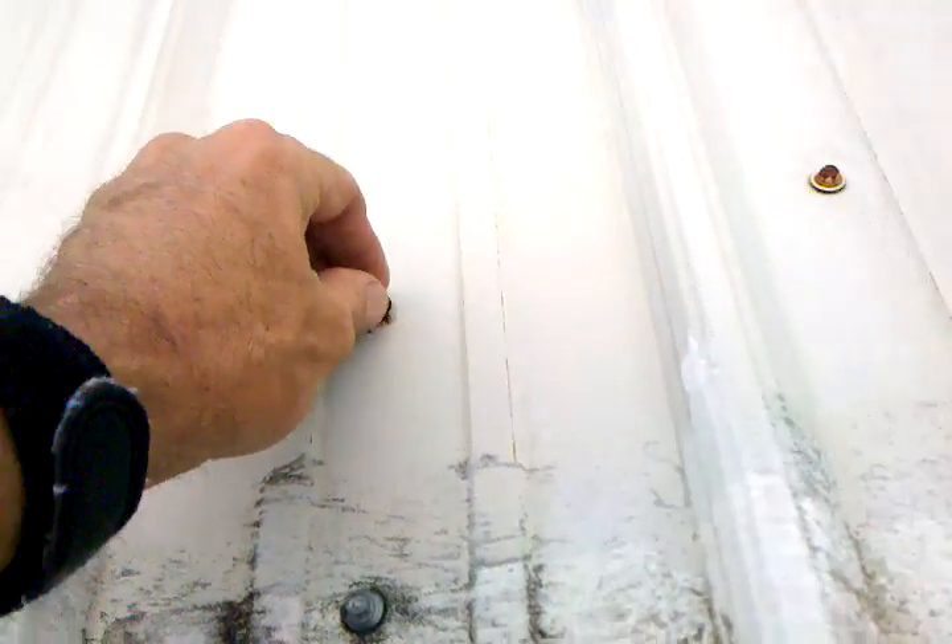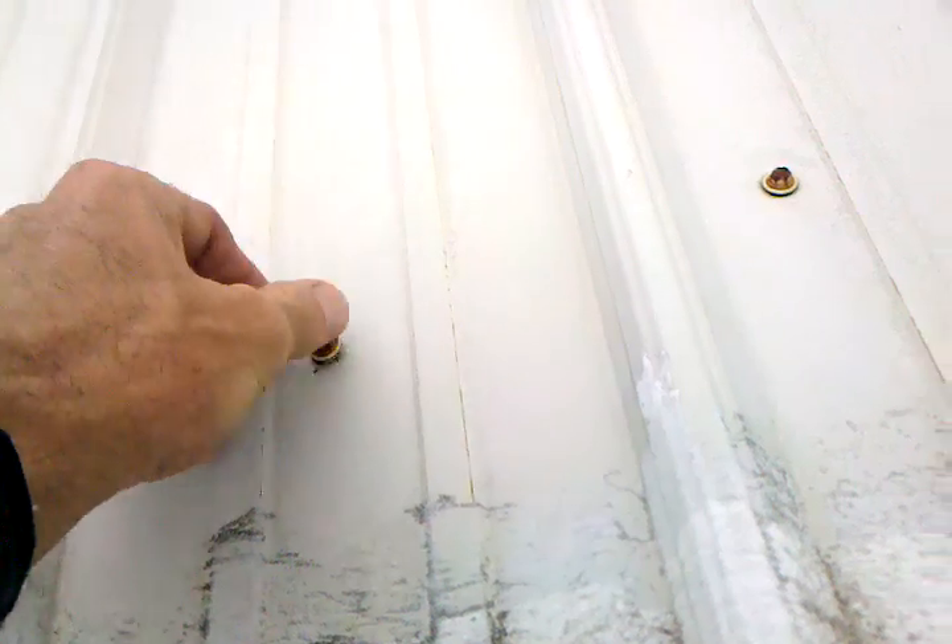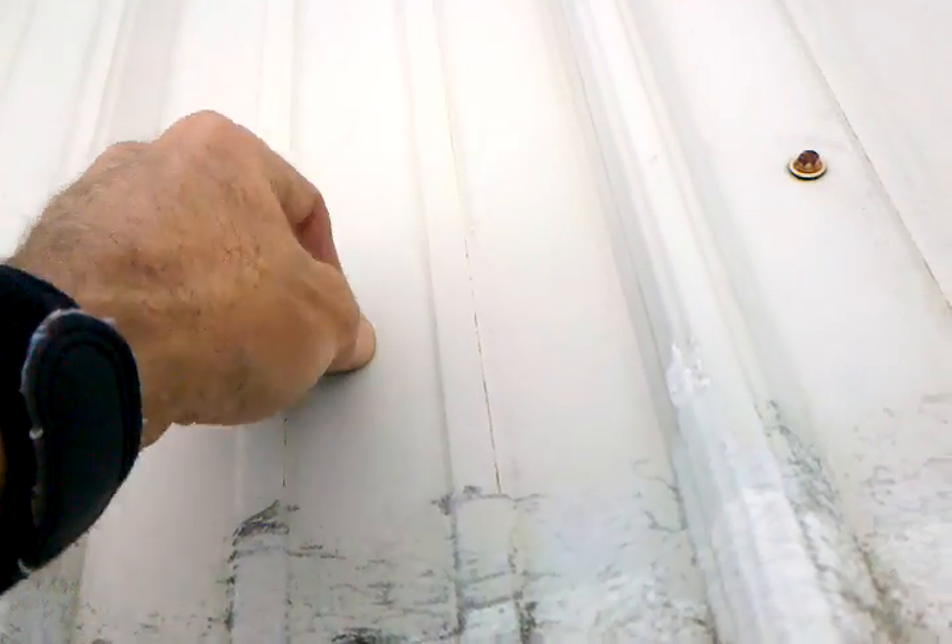The other weakness with these panels are the fasteners. The lower ones are sealed down tight and the ones up top are never an issue, but as water flows down, it's trapped between these two channels in each spot and you get greater hydrostatic pressure as it comes down. We can see from this screw right here that it's backed out, and that means there's a hole under there that's open. I'm going to screw it down tight to try to help out a little bit.